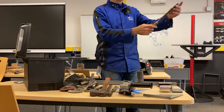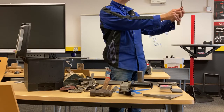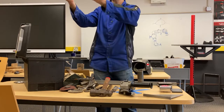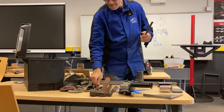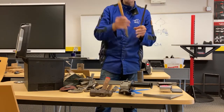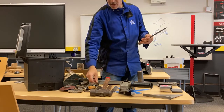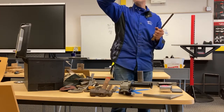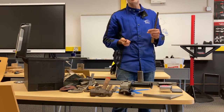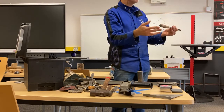This safe edge square file is one I've had for many decades and it's never let me down. Also — get handles for your files. It's very easy to have the tang go into your wrist if someone bumps you, or go into your gut. A handle gives you much better grip. File handles can be bought separately — you can buy bags of them.